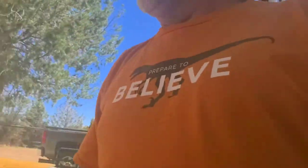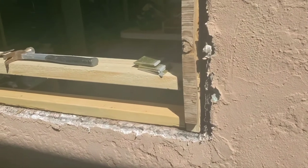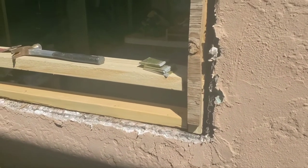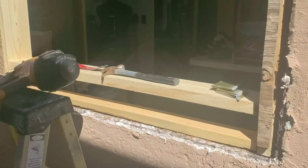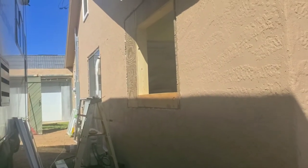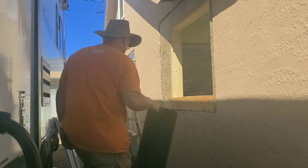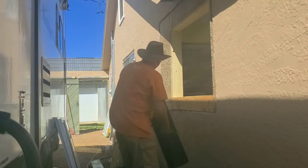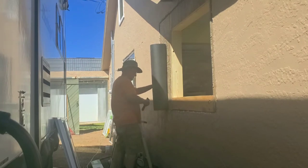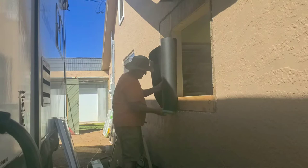I'm just using scraps. There are 16-penny nails in there because that's what's in the gun. Three-quarters is a little too thick — might go with some half-inch on the other window. I just don't want the stucco to get too thick around it. I use 30-pound felt paper — I've used it for a long time. 15-pound is just so cheesy.